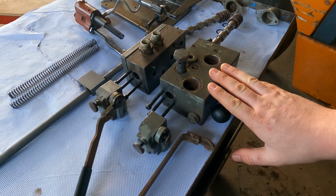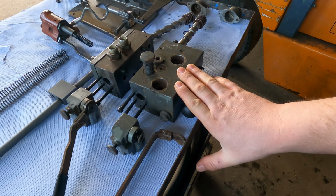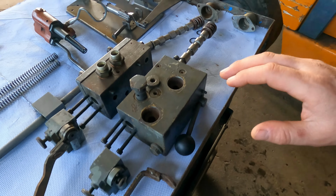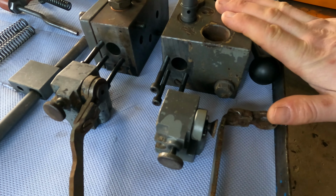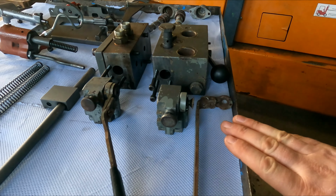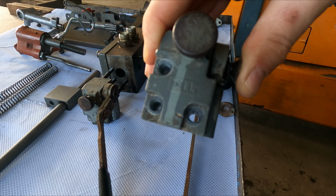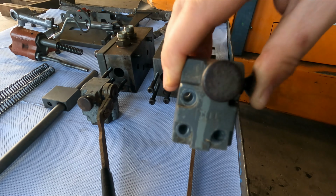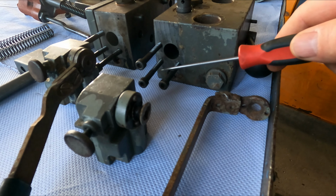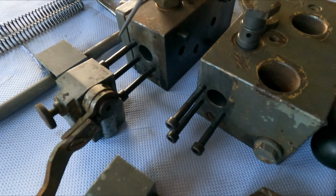These Till valves, which I think these days are marketed by AK Hydraulics in Helmstedt in Northern Germany. It's like an hour away from us, maybe 45 minutes. Till Hydraulics are also in Helmstedt, and AK Hydraulics are in Helmstedt. They probably belong to the same company. So, like I say, if you've got these Till hydraulics, you'll know it's a Till hydraulic because on the lever body there should be Till written on the top. They are the originals. The older versions are usually with three screws. The newer AK versions are, I think, with just two screws for the valve lever bodies.